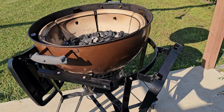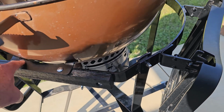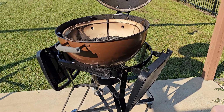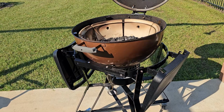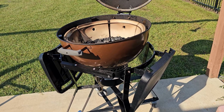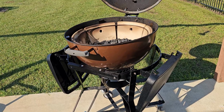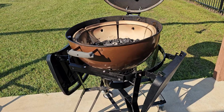But when you're mounting your bracket so low on this shape of a kettle, the diameter is much smaller here than it was here. And I think the 18s probably would have taken a little less manual manipulation, because of course they're not built for this unique application. I simply used it for this, and so whenever I do that I have to get my vise out and my vise grips and maybe a little hammering going on, a little trial and error. But it's not that difficult. It just takes a little bit of finesse, and you don't want to just tighten it down to the body of the kettle, because the body of the kettle is not as strong as those brackets, and the body of the kettle would end up bending, which will crack the ceramic coating on the outside of the kettle.